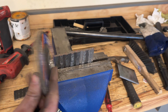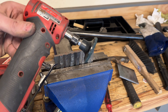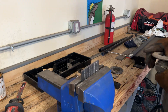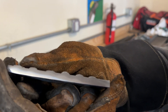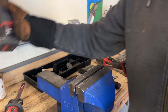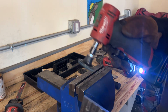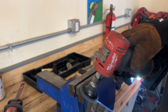Go back with an 80, and then I go at it with a green scrubby on a die grinder. You don't want to spin this too fast. Let me reposition the camera and start cleaning this. You can see that's pretty clean as it is. Now I'm just going to do it by hand without it in the vise, and I'm just going to buff it to where it looks shinier. I use the light in my shop to kind of give me a gauge.